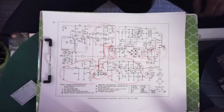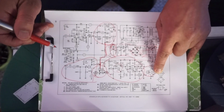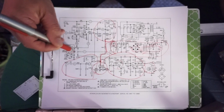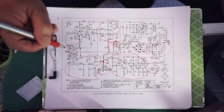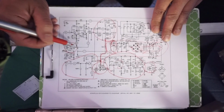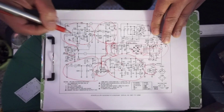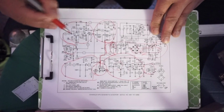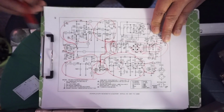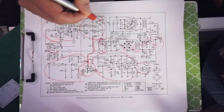with transistors and everything. And then you jump up here, and there's the playback head. Once again, I'm looking at this upside down. Here it is. And so this would be the output of the digital delay line in our case. Think of the block diagram that I showed you just a moment ago. And it goes through the playback amplifier here, which is super high gain. It's a negative feedback amp, and if I were to take the negative feedback out, it'd be like an all out crazy fuzz pedal. And then that joins up with the dry signal here at the mixer stage.